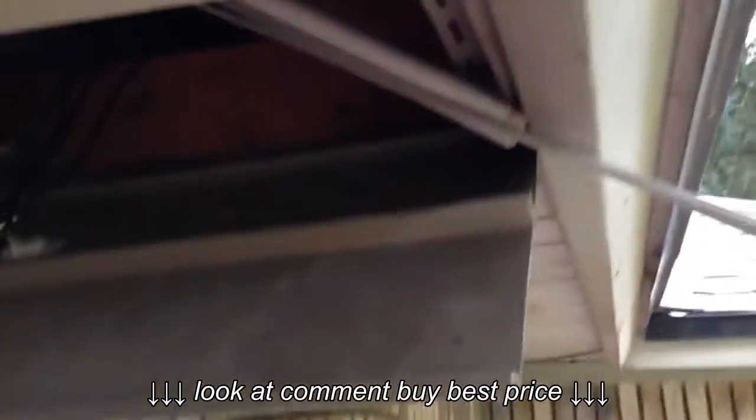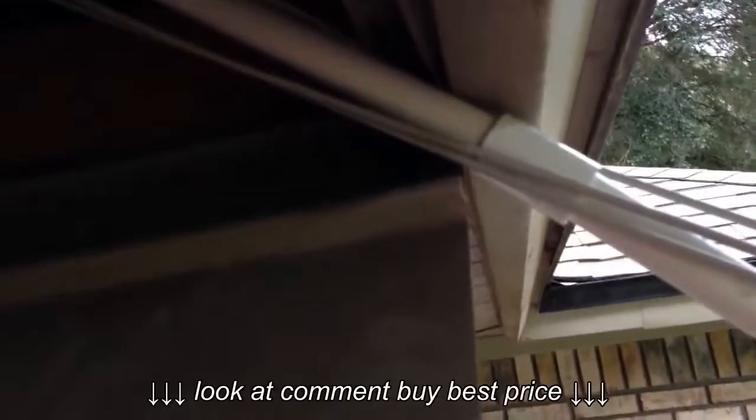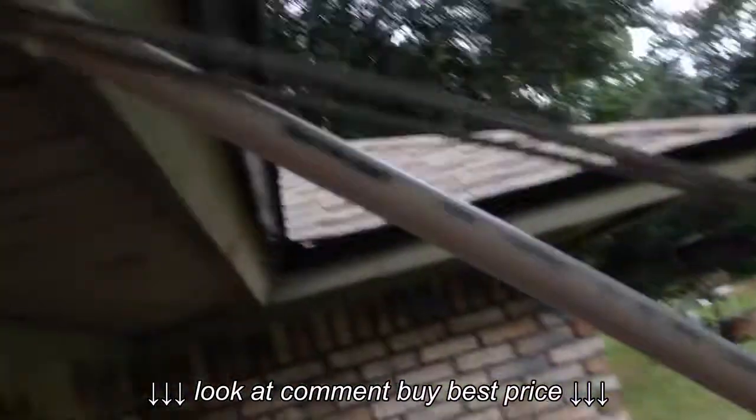We're going to do a trick here though. Let's make sure I have enough room. We'll couple it with another pole. Alright, I've got the end coupled with the other pole. It's another 10-foot section, 1/2 inch PVC. I'm just going to slide that the rest of the way until it stops. And it's on the stop. So I'm going to have to crawl up in the attic and fish it out the rest of the way.